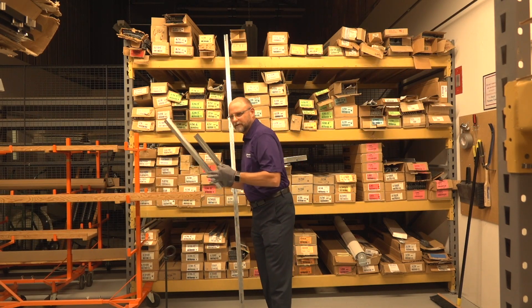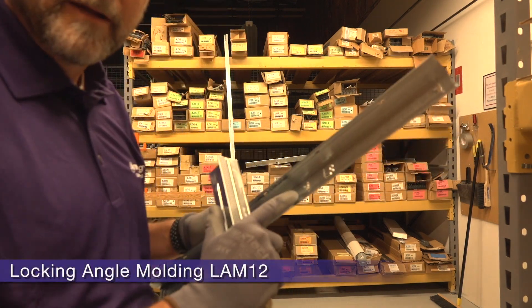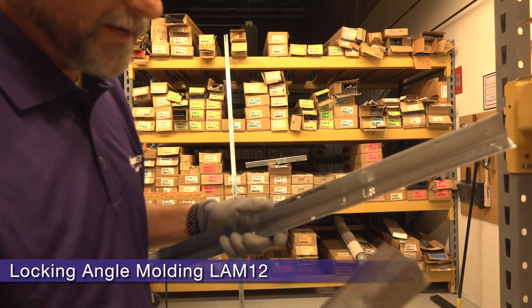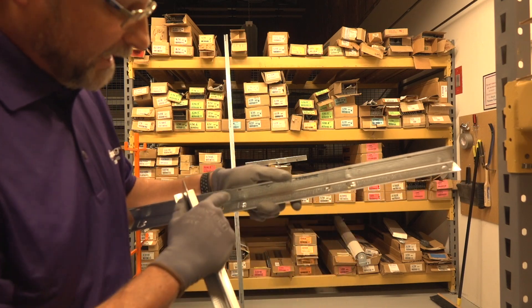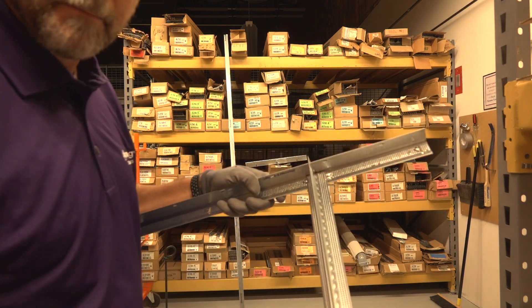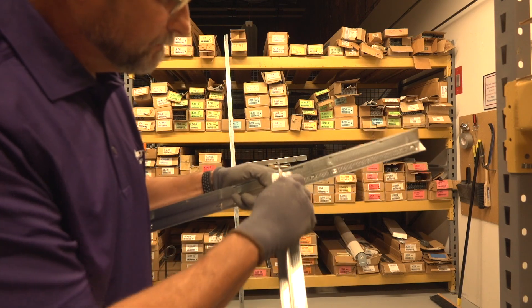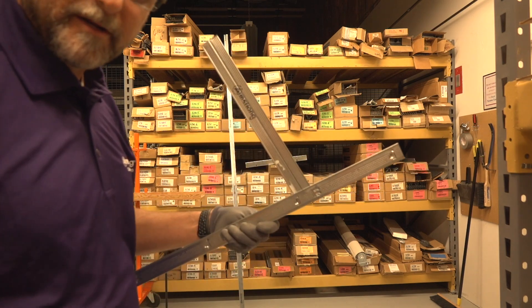Let me show you one other thing that makes you even more productive with Short Span. We have this product called LAMB — that's Locking Angle Molding. The locking tabs on this angle are eight inches on center. My T's simply lock into place; I don't have to measure for T placement. I simply lock them in place and no screws are required prior to installing the drywall.